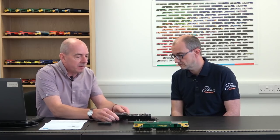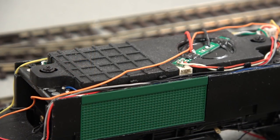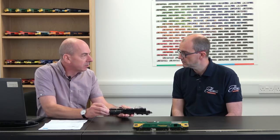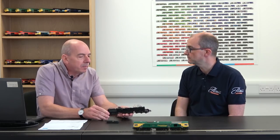We've got a chassis here and as you can see, the speaker sits just there facing downward. It's quite a big speaker — bigger than most locos have factory fitted — and a very high quality speaker. The bass performance is incredible for the size of it. Why is bass important? Particularly in a diesel loco, they're very gutsy, bassy beasts, and if you can reproduce that in a model you need that bass performance. And obviously coupled with an ESU version 5 chip, the latest generation of chip, we've been able to produce a quality sounding loco.